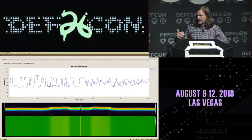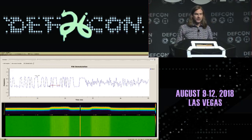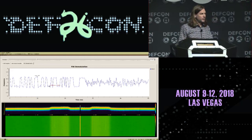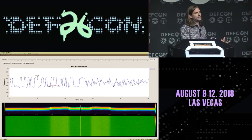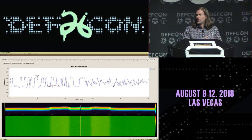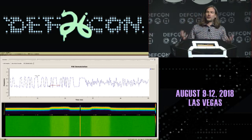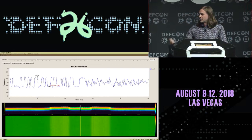And we've now taken a 1-capacitor circuit and used it to interface our general purpose microcontroller with a salvaged radio tuner and repurposed it. So instead of just being a TV tuner, it now is able to help us in software demodulate and decode arbitrary radio signals, including the digital signal from Dominic's key fob.